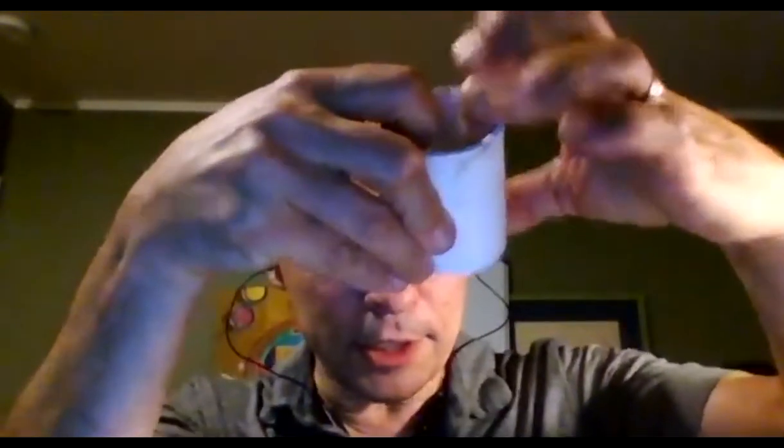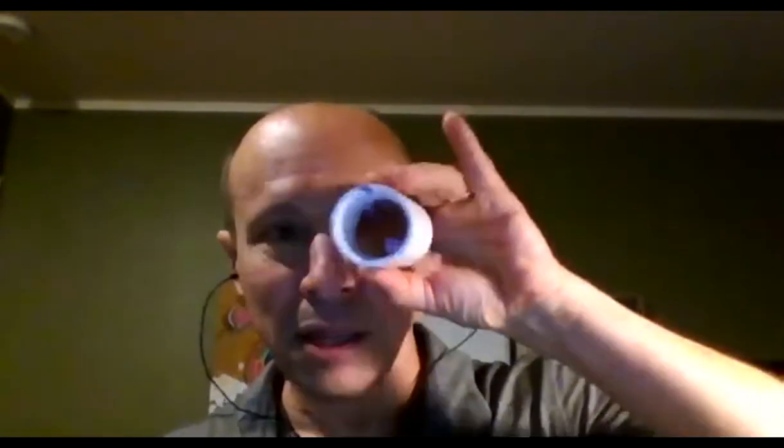Symmetric, isn't it? Yep. Then you're gonna find in your bag a little ring, okay? The ring tapers, there's kind of a sharp edge. You're gonna put it dull edge into your white piece of plastic on top of your lens, slide it in there, and then push it all the way down inside until it touches the lens all the way around. And that keeps the lens from falling out. We used to do this with tape, and this is much better. So now that lens doesn't fall out. It's still in there, and it's nice and secure.